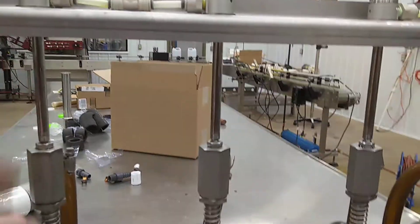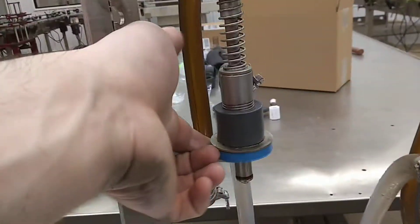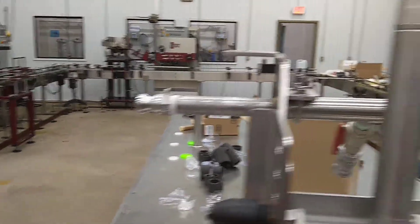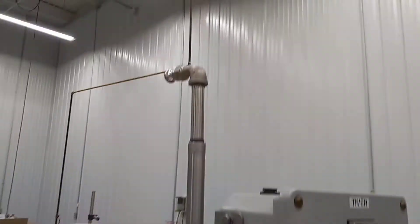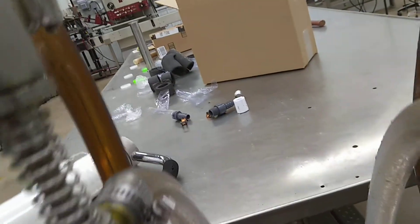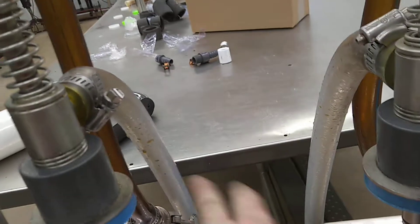The way this works is an air cylinder comes up and then when you hit the start timer you can jog it manually or set a timer. You pump filtered syrup through this — the head pressure actually allows the syrup to come back down in the bottle, and when it pushes down the bottle it will pick up that valve and there's a little tube that will actually flow back up in and overflow out the handle here.